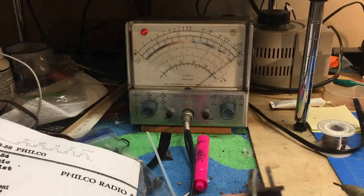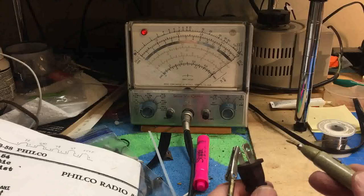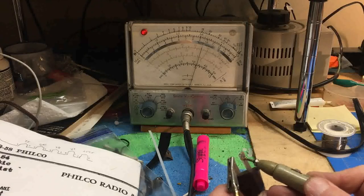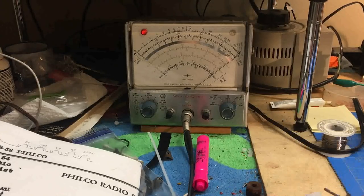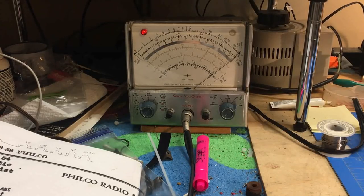This doesn't mean there's nothing shorted in the high voltage, but for the filaments we're reading about 180 ohms - which is about right when cold. At least it's not dead shorted. We're still going to bring it up with a variac. This is just a preliminary check to see if anything in the line makes it shorted. There's no guarantee that when we bring the high voltage up there won't be any problems, but at least we have that preliminary check.